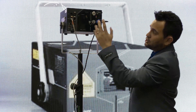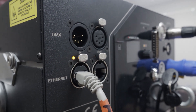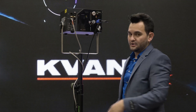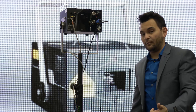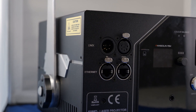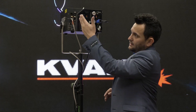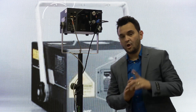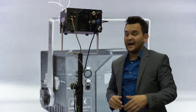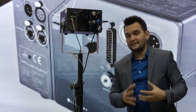On this side of the FB4, for DMX control it is a five-pin DMX standard — you've got in and out. The way it works is you don't just plug in and choose some pre-made patterns; you load your entire show into the micro SD card and control it from DMX with any lighting board. If you're going to use Artnet — because this is Artnet compatible — you have in and out as well for Beyond control. So it's a dual function: I can connect all the lasers together and into my next Artnet fixture and control it with any DMX console, or I can connect the lasers together with CAT5E or CAT6 cable and control it with either Beyond or QuickShow. You get a little bit of flexibility. To control via Artnet you have to preload your show into the micro SD card, but while that may sound limiting, it really isn't — you can load so much into it. This is a custom FB4 designed to maximize everything the laser can do.